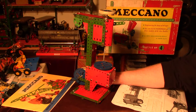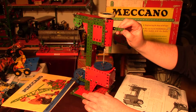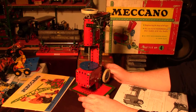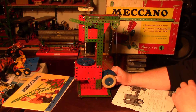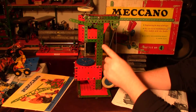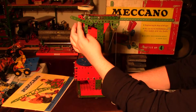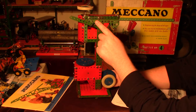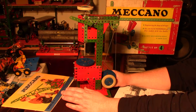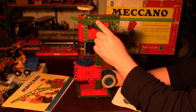It's a drilling machine so you need to lower the drill to the piece of work you're drilling, which you do by operating this lever here. It only moves perhaps half an inch at most. On this side I've done two things slightly differently: I've fitted a new drive band to act as a spring to return the drill to the raised position, and I've added a couple of washers to bring out the lever so it clears the bolt and raises a bit higher, giving a little more movement. The original rubber drive bands in the set aren't in brilliant condition and aren't quite long enough, so I used a newer one — probably only about five years old.